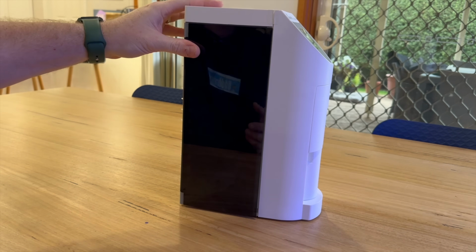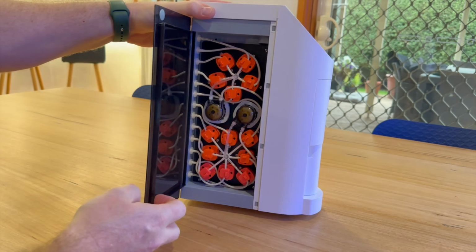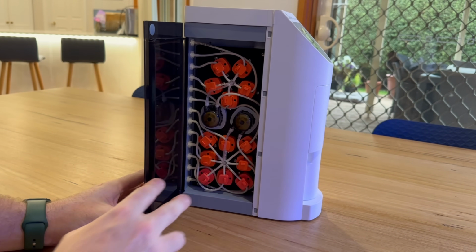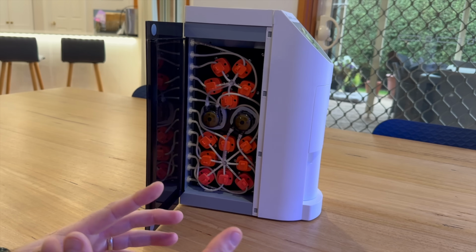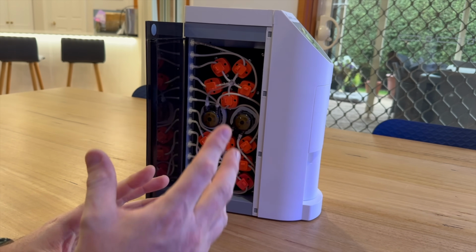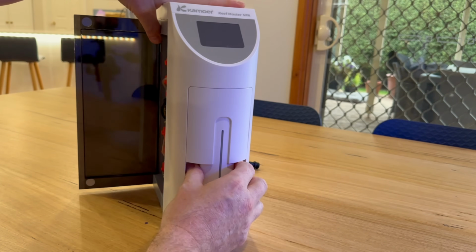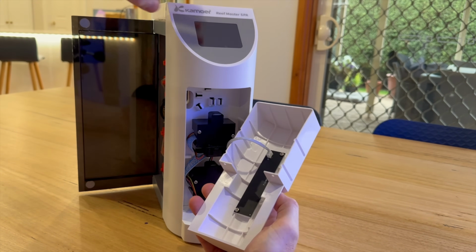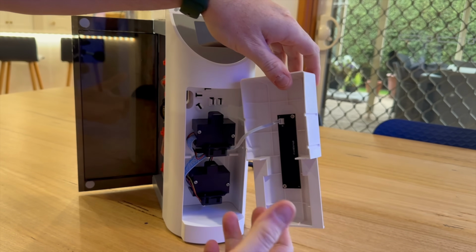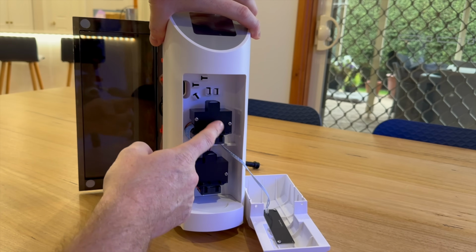All right, at first thought, this looks like a pretty complicated device, particularly when you open up this side panel here and you see these two pumps and these huge number of pinch valves. But what I soon worked out after watching it in operation is that it's basically two colorimeter testers, as far as I can tell anyway, that are housed in this front section here. And in fact, if we pull this little section off, which just has a little connector, this little light indicator just gives you a status that it's doing a test. You can actually see here the two different colorimeters there.